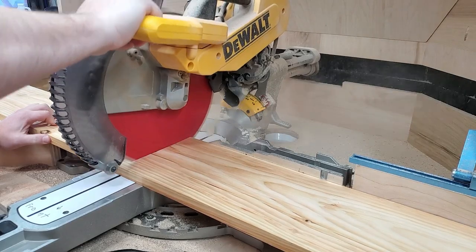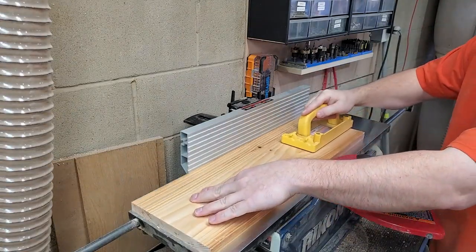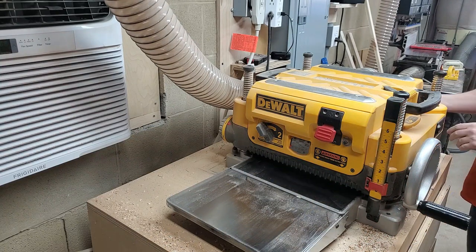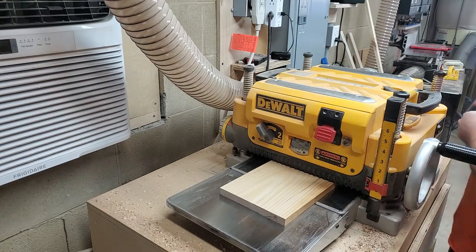The first thing I want to do is chop off what I need for this project. Although this board is in pretty good shape for being a 1x8, it's bound to have a little bit of a cup and a little bit of a crown in it. So I'm going to hurry up and mill that out before we get started, because I'm going to go with a miter joint here and that will mess up a miter joint in a hurry.